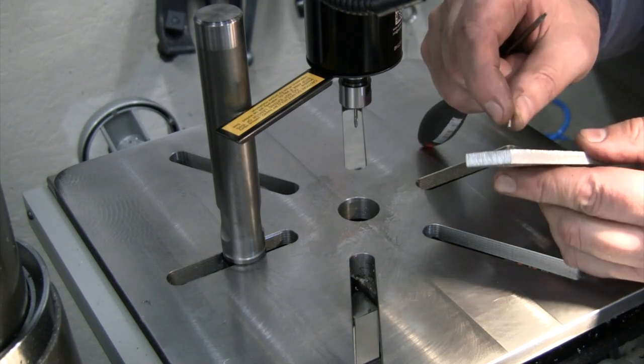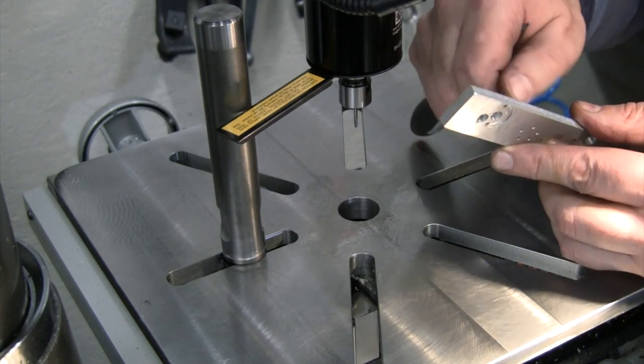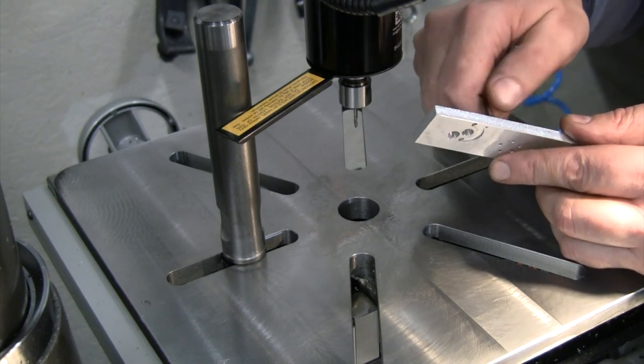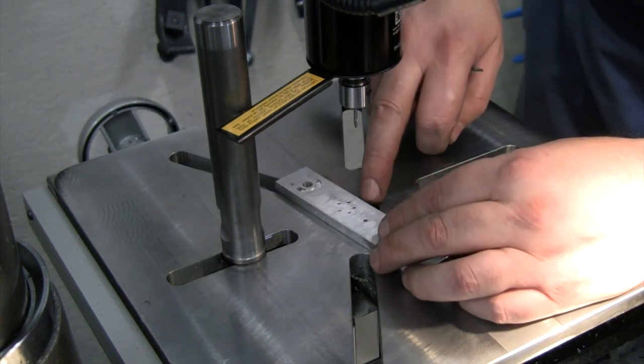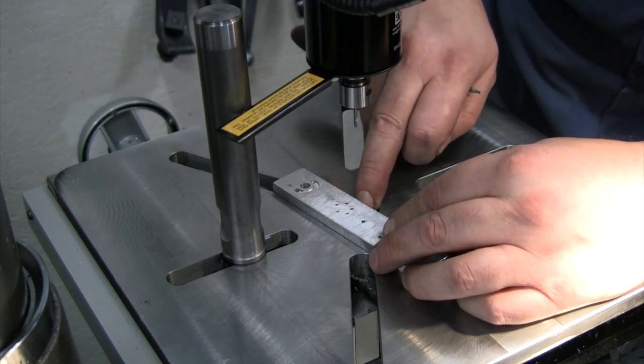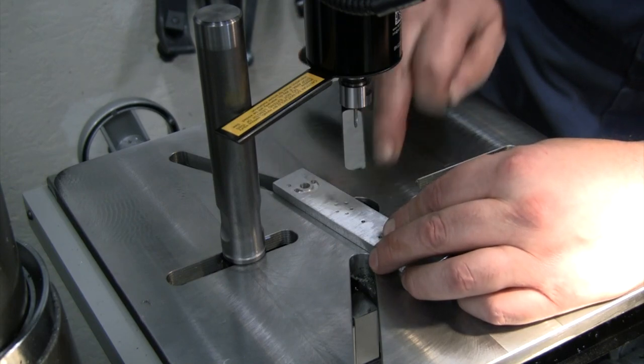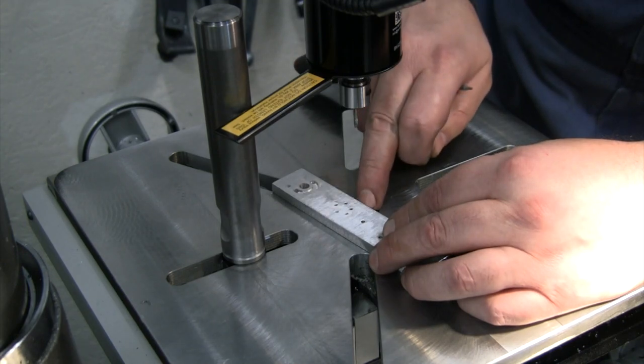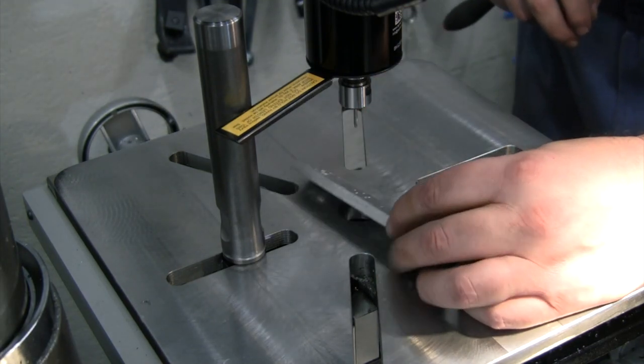So even if I'm putting on the pocket clip, these are the longest screws I'm gonna use. They're not gonna go all the way through. So that is gonna tap in there far enough. So I basically set that so that my stop was right at the tip of the plate, and then it was gonna pull it through 3 millimeters farther, which accounts for the taper on this tap. So that's what I've got, that seems to work.